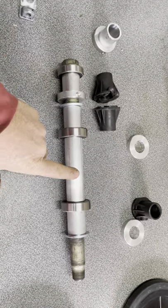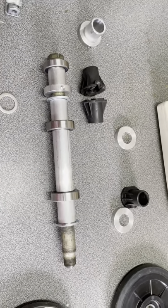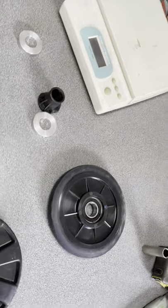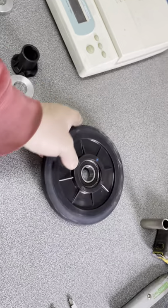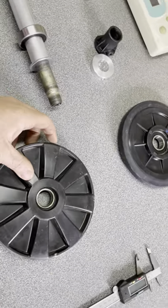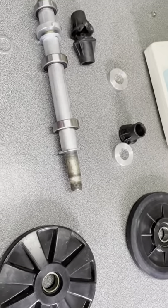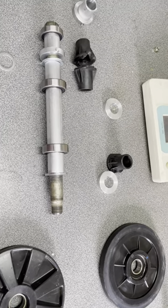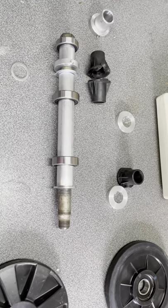I've been selling fourth wheel kits for a couple seasons — basically some spacers. The spacers are all machined to accept wider bearings. Some of these heavy-duty wheels that I sell have a wider bearing in them. But if you want to use the OEM wheels, you just basically add some shim washers, which I include. So it's nice — it gives you versatility. You can utilize your stock wheels if you're not ready to spend money on better wheels, and then you can always upgrade them at a later date.